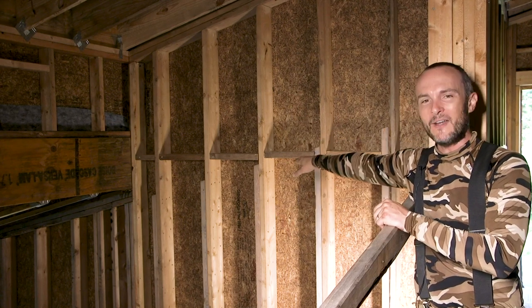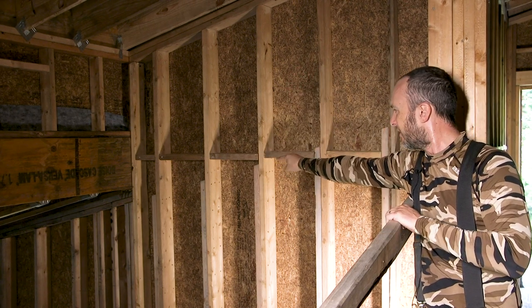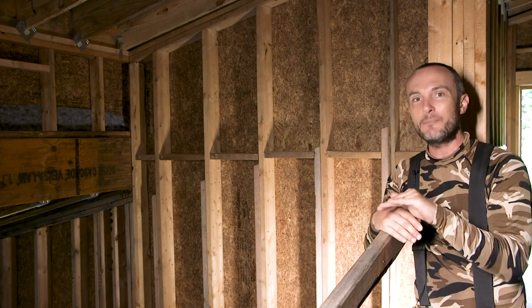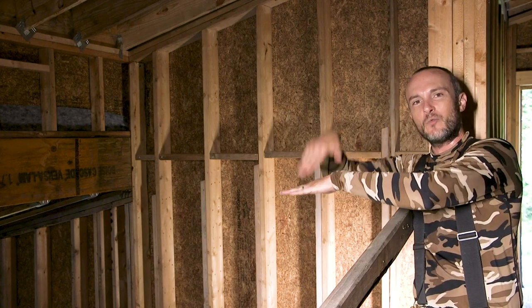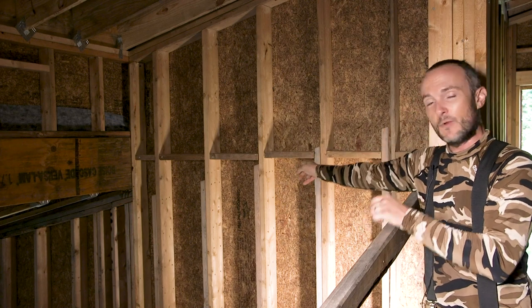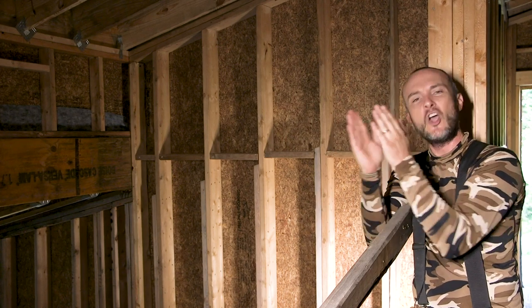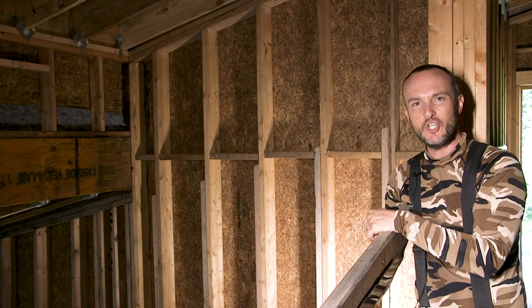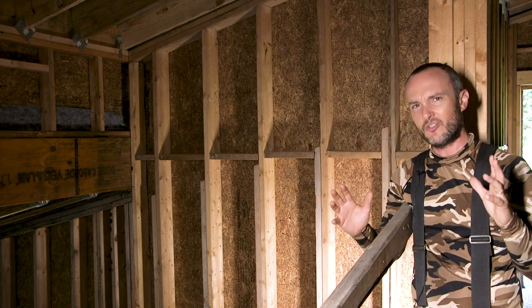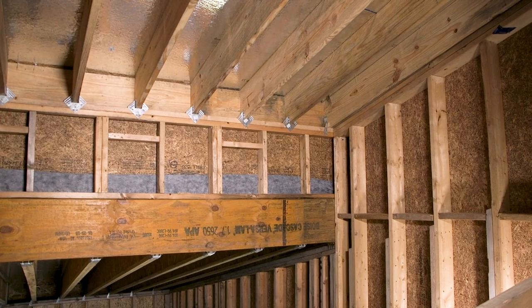Here's the thing. You can see the roof coming along and then it jumps up for this dormer. There are some studs that follow the line of the original roof because I did not review the structural engineer's plans closely enough. He specified not to put a break — basically a hinge — in there, because a wall built on top of another wall becomes a hinge where they could fold over on themselves. So one continuous stud is what's called for. We fixed this by fastening another long 2x6 onto the existing one and raising the top plate so the dormer is now properly framed.